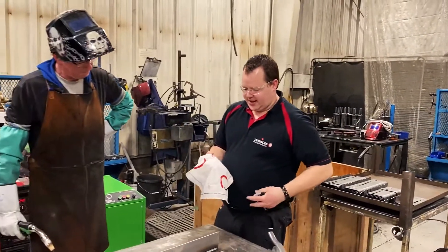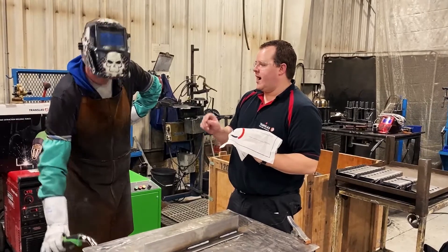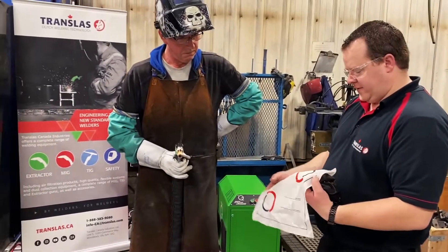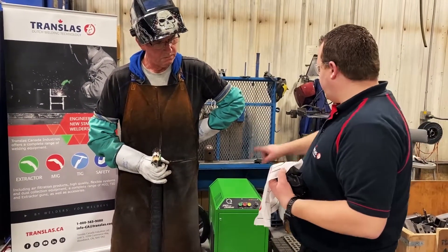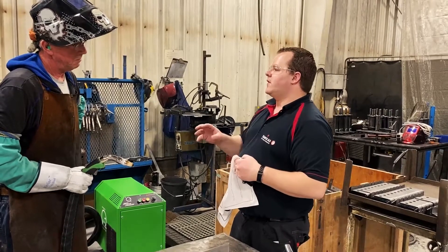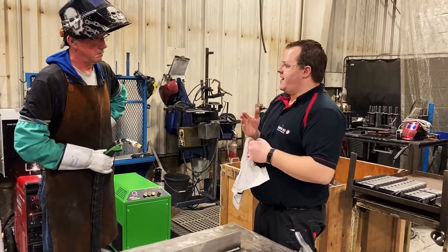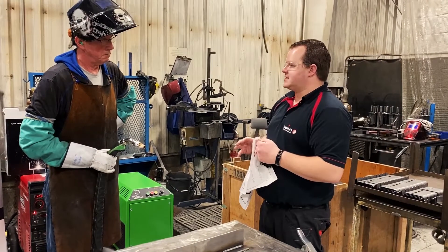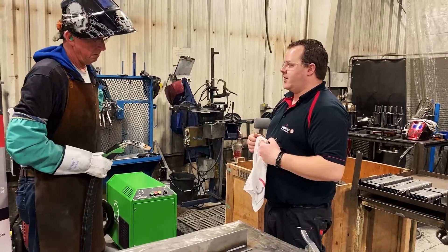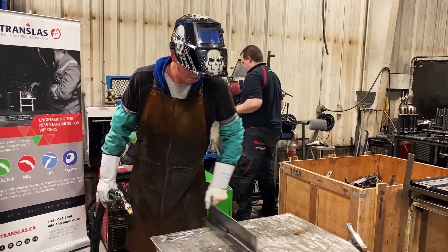So what we're going to do now, John, is I want to show you how much fume you're actually pulling out by using this. I'm going to put this cloth here — we're going to do two tests. I'm going to put on my hose, we're going to weld 10 seconds, and then we're going to take it off and then do another weld of 30 seconds. You're going to see smoke rise because I'm blocking the hose — that's not the point of this test. The point is how much we're actually pulling out of that gun, or fume in particular.